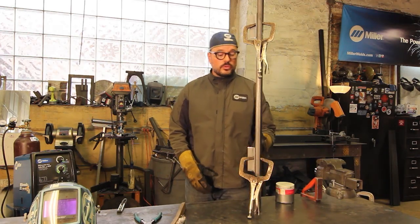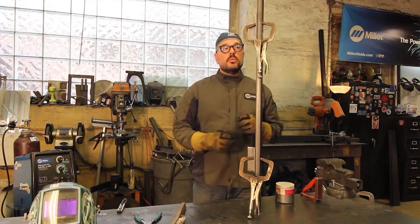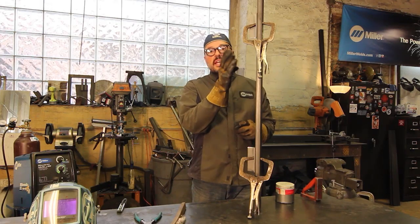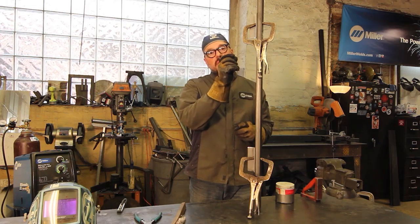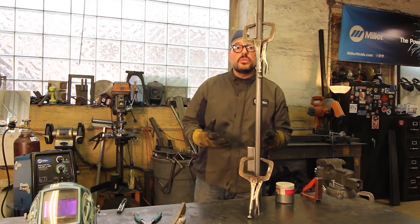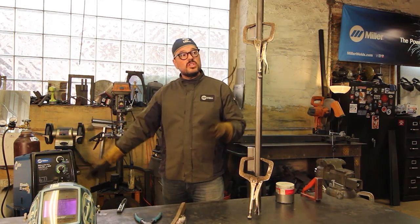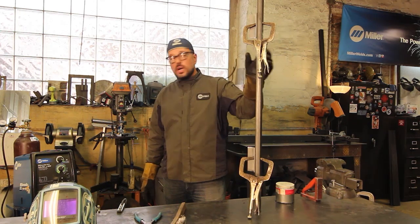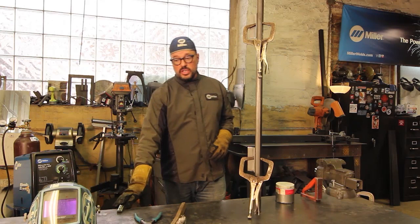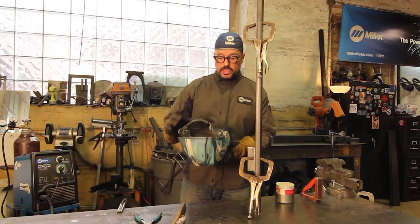So that's what we're going to do — 45-degree work angle, 45-degree drop angle, and just the falling leaf technique. We're trying to make 1/8-inch legs on either side, keeping that puddle the same size as we drop through the weld. Going through the checklist: 30 CFH, set for 1/8-inch material. Make sure your work clamp is down, gear up with all proper safety gear, and here we go.